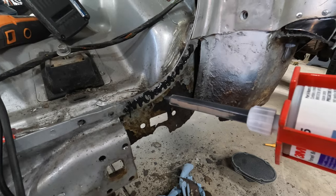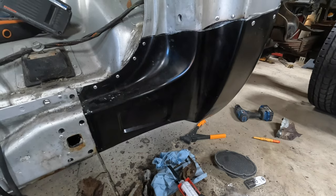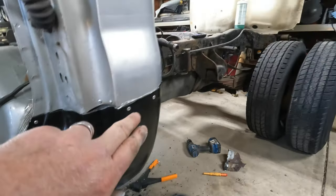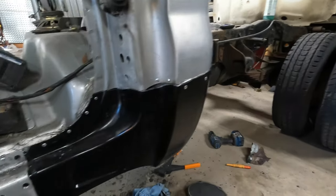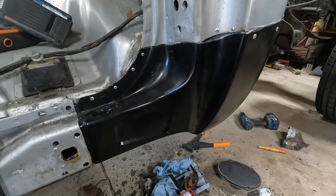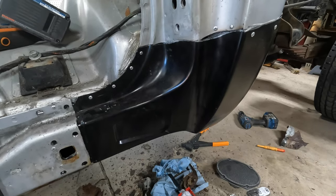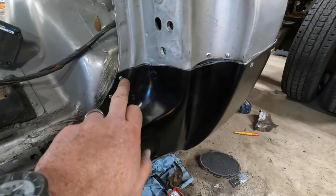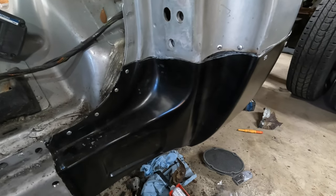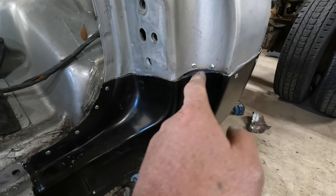The nozzle is also sacrificial — keep that in mind. If you want to use this tomorrow, you'll have to throw the nozzle away and use another one. Now I have the corner in place and glued. Basically every couple of inches along the seams or anywhere it is glued, I put some rivets. The rivets are just temporary — it just keeps everything tight until the glue cures. It takes 24 hours for this glue to cure, and I highly suggest you let it cure for 24 hours before you start working with it. After the glue dries, you would drill out all the rivets, because these are aluminum rivets and aluminum and steel causes corrosion — so you don't want them in there.